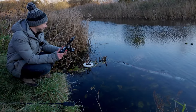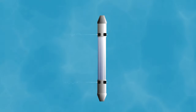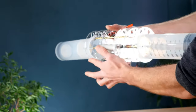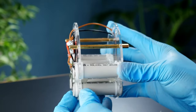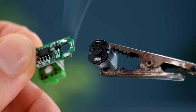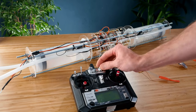James's design works like an actual submarine. It uses these huge syringes as the ballast tanks and compresses them using a pair of geared motors. It moves around laterally using an array of water pumps that work like thrusters. As is typical of James's builds, there's really nothing fancy going on here other than his ability to problem solve. The battery pack is just a series of 18650s in an acrylic housing secured with some zip ties. The ballast motors are these geared DC motors you've probably seen in other projects, though here he's scavenging the control board from a servo motor to make it easier to control using an RC transmitter — he's basically turned them into a really long throw linear servo.